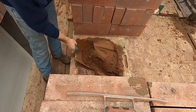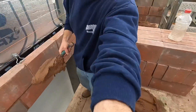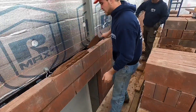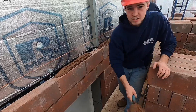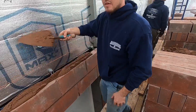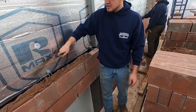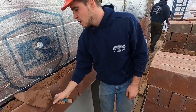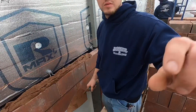There you go. So you want to roll it, roll it, and then come over to your wall. Spread it across — sorry about the wind, it's terrible. Spread it across, then you want to feather it like this. I'm going to cut away the excess, filling where it's low. And that's how you spread some mud.